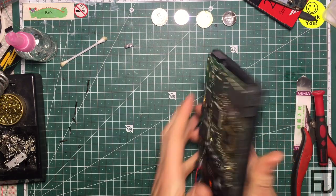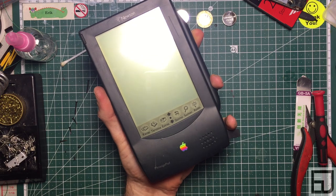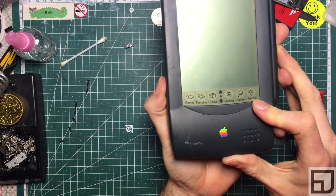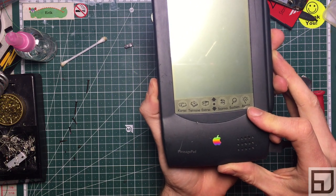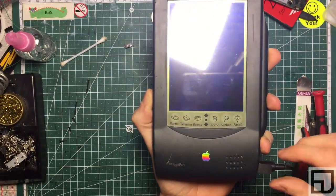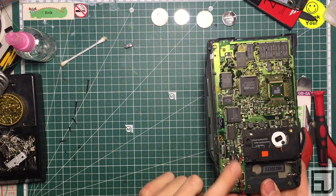Let's see what happens. Plug it in, power it up — sound! It chimed. But still, the video is not there or messed up. You can hear it clicking. So half of the problem is fixed. Sound issue resolved with this capacitor.